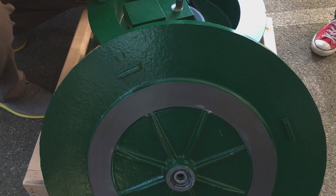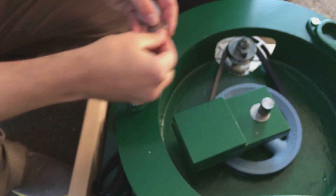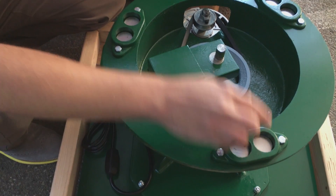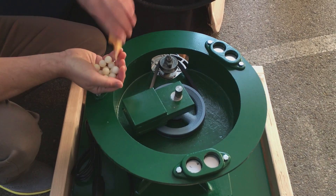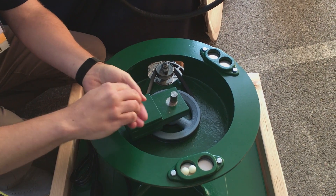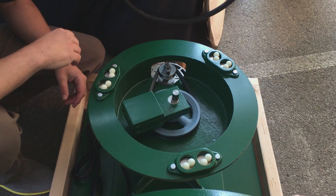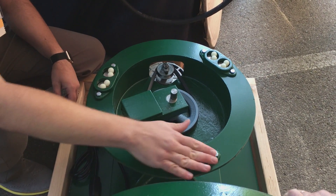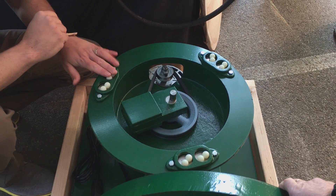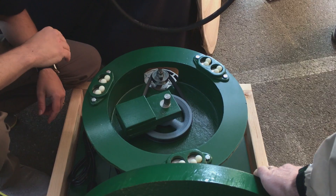Once your raceway is clean, the next thing you want to do is take your steel plates — you'll have six of these — and put one in each of your little bearing keepers around the base of your Reciprolap. Once your steel plates are in, the next thing you'll have are nylon balls, two of each in each bearing keeper. You want to fill just over the top of the plate with about a 40-weight oil. You want these to be lubricated as they work. Make sure you get oil in these bearing keepers, otherwise your Reciprolap will not operate correctly and you'll wear out these nylon balls extremely quickly.